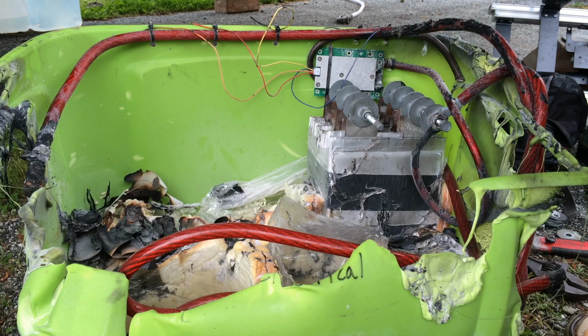However, when you're charging and discharging a pack like this, the inverter knows once it gets below a certain voltage, it's going to shut it off, so it's going to be safe. The inverter will shut off at 10.5 volts, and these are good down to 2.5 each, which means 10 volts. So these would have been fine with the inverter.